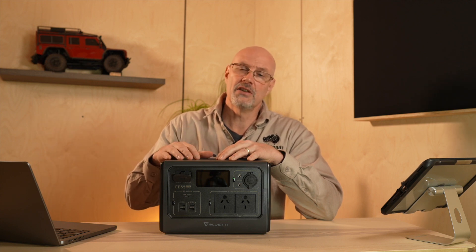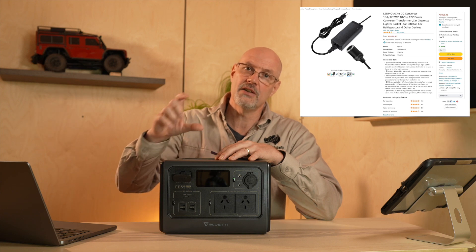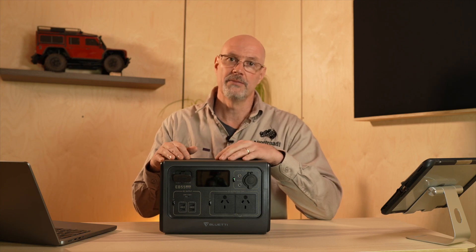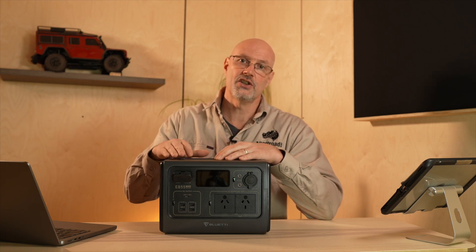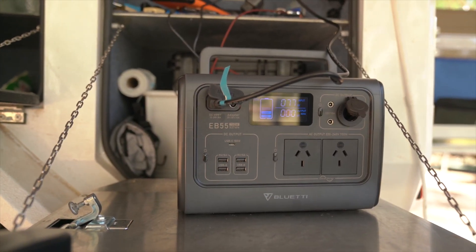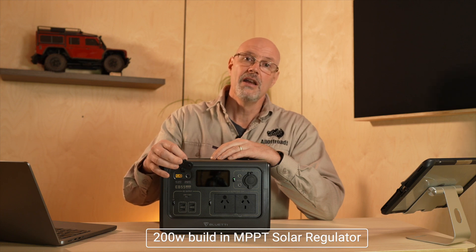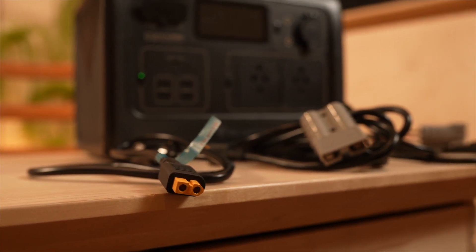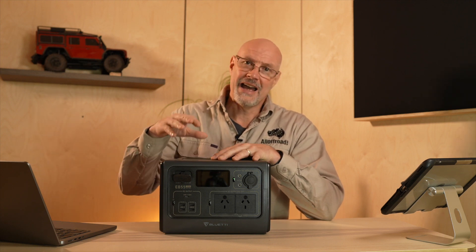You can purchase on Amazon a 120-watt power brick for the unit — not from Bluetti, just a third-party option with a cigarette lighter plug — and that is fanless, so no noise. However, it will only charge at 120 watts. The Bluetti power brick charges at 200 watts, meaning in about three and a half hours you have the unit fully recharged at home. The car charger only charges at around 100 watts, so it will take around seven hours. I also used a 300-watt ATOM Power solar panel and never managed to get more than 170 watts in.